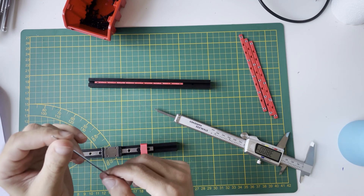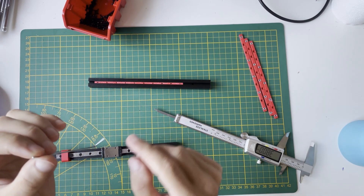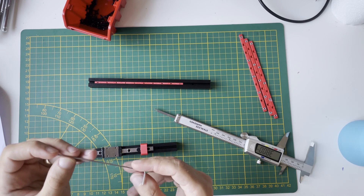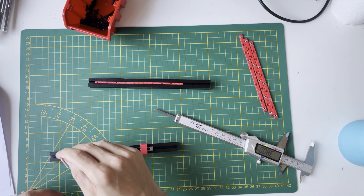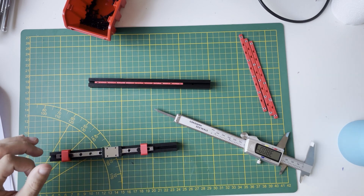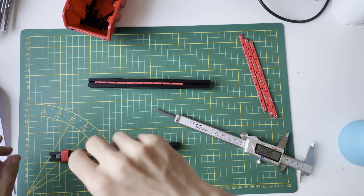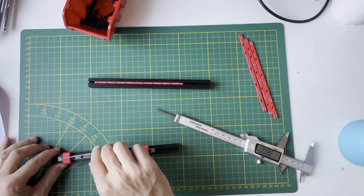Put the centering jig back in and tighten, starting with the first and last. We don't need to over-torque these screws — just firmly tight. During the final tightening don't use the ball end of the hex key, because this is M2 and you can break the ball end, or strip the screw head. Use the straight end for the final tightening, but don't over-tighten.